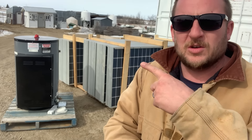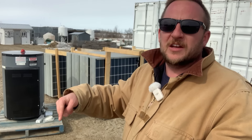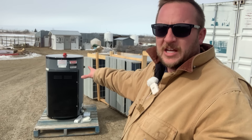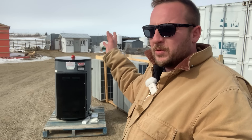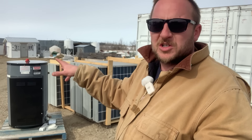The problem with this tank is it's only 50 US gallons. I was thinking about making my own tank — for literally 20 to 40 bucks you can get resistive water heating elements. They say they're for 220 AC, but because they're a resistive element for heating, you can fire DC directly into them and it'll vary as well. The water is going to get super hot, so I have to put a thermal switch on it with a pump and probably use IBC totes, insulate them well. When the water gets too hot, it'll transfer the water or glycol into the insulated storage tanks.